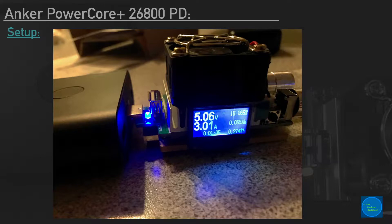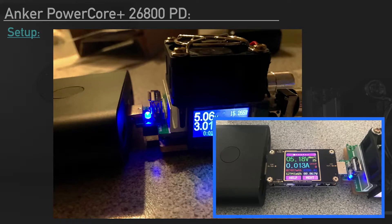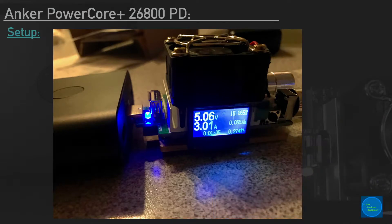I wanted to quickly show the setup. I did not end up using the USB multimeter in between the battery and the load, because the USB multimeter appeared to have some sort of bug that caused it to erroneously report the capacity when the power was cut — when the battery reached its end of charge — and would give me capacities like 70,000 milliamp hours, which is just not correct. So I ended up using a simpler setup, which was just the battery, as shown on the left here, plugged directly into the load, which has its own display and can measure the voltage and current, and give you an overall amp hour rating as well as the watt hour ratings.